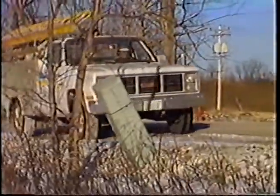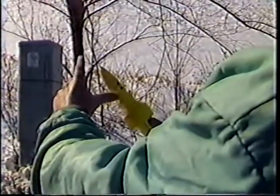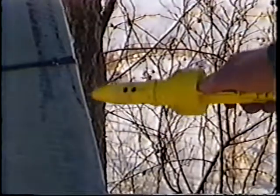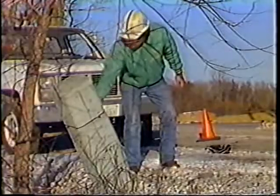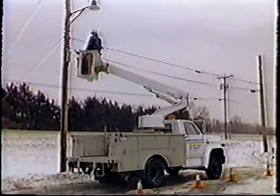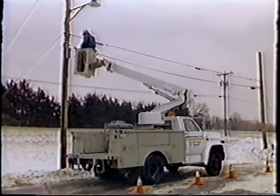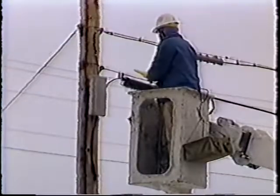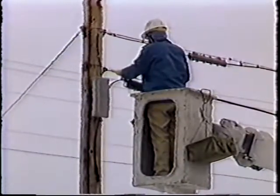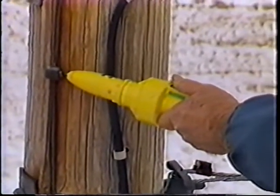Telephone company facilities may also be placed near power lines underground. Like aerial applications, any number of things can cause the telephone facilities to become energized. Whenever you're working on a buried plant, be sure to use your 188A and test first. Power surges, down poles, and transformer malfunctions are just a few of the ways that an object like a streetlight fixture can suddenly become energized.